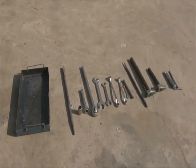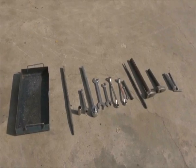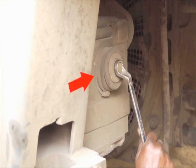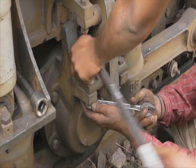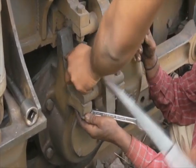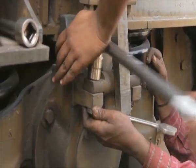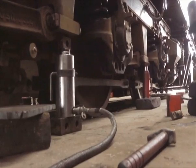Toolbox containing wrenches and spanners. Slacken the brake adjusting equipment of the defective wheel set. Uncouple the axle holder and secure it. Arrange jacks for providing resistance.